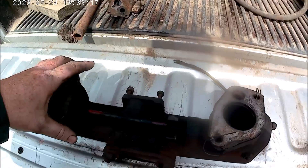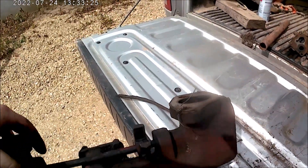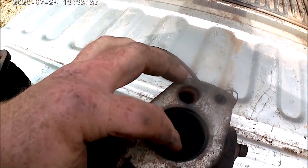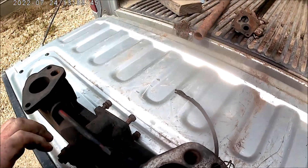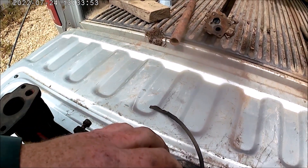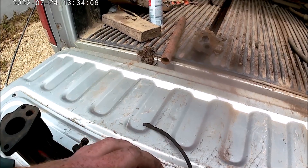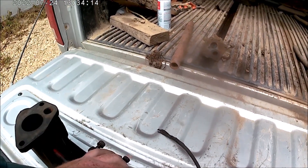Here's the WD-6 intake manifold — or MD — they're the same design. There's a port that goes to your carburetor. These are the main ports when it's on diesel mode — the butterflies are wide open. When on gas, they close and force the air to go through the carburetor. These ports actually come from the carburetor. On diesel, air goes through the intake valves normally, but when the butterflies are shut, air-fuel mix must go through the carburetor port to allow it to run on gas.